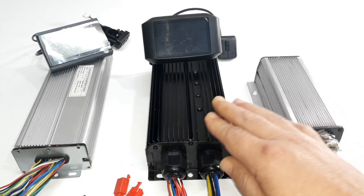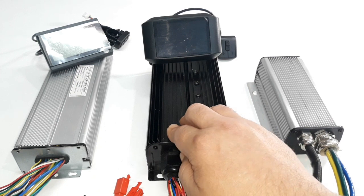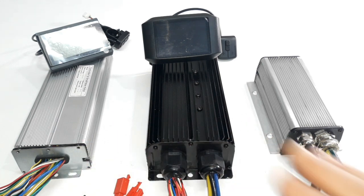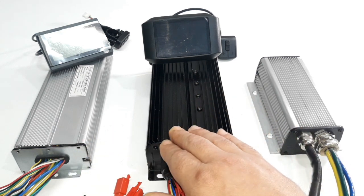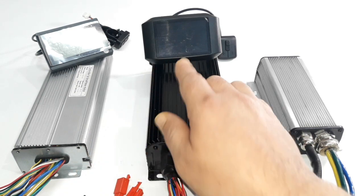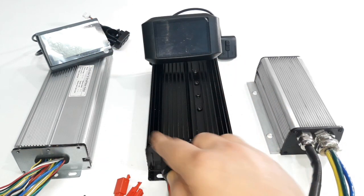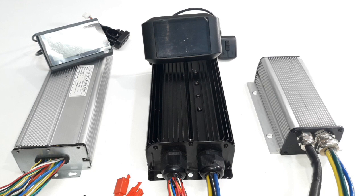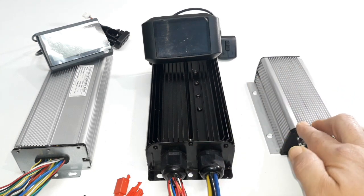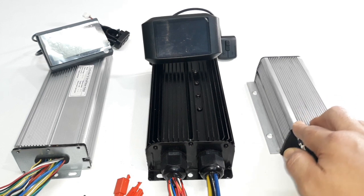On the other hand, these two controllers are designed for electric bicycles, motorcycles, or similar vehicles, which means they are very easy to install — almost plug-and-play. You just connect them and they work perfectly, and you only have to change some little parameters through their own screens to change the behavior of the controller and the motor. The Kelly controller, however, requires connecting to a computer and working through many parameters to make it work properly for your needs.